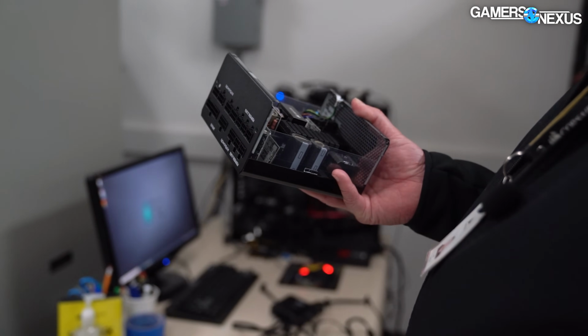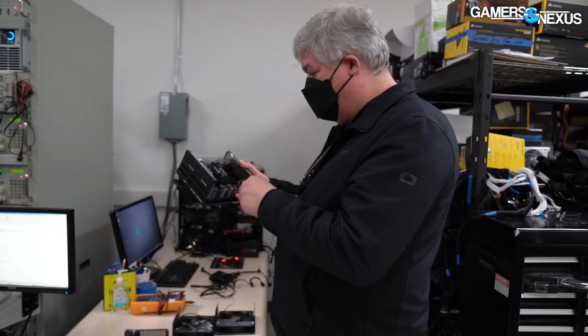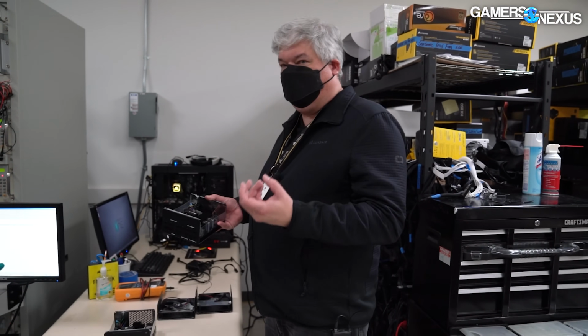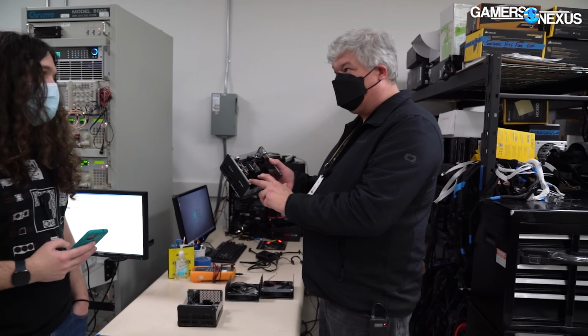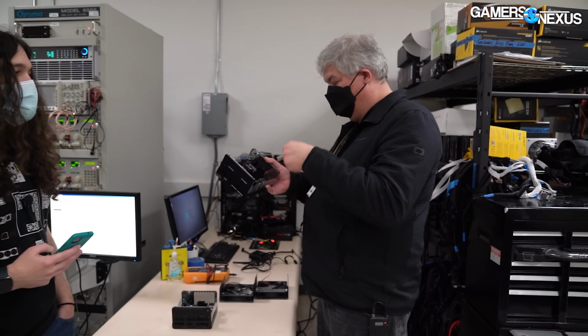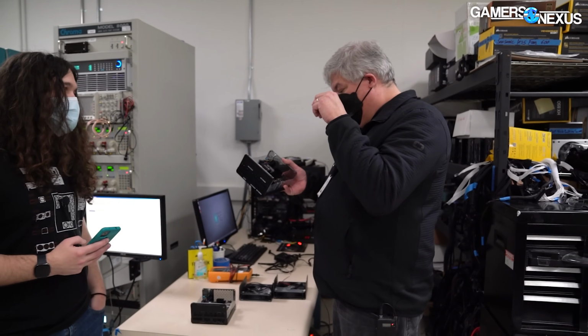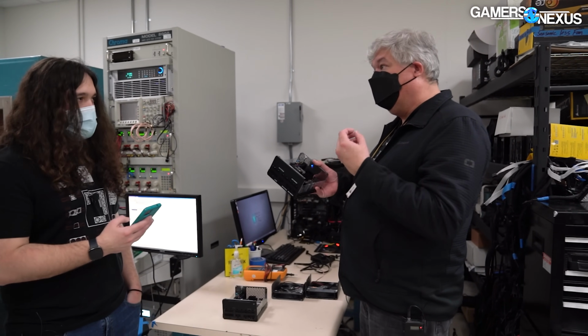That's not a bad thing. The reason for it is that with the pressure coming down from the fan, you don't want to only rely on the heat coming up from the components to the top of the heatsink before it gets cooled. You want to get the air through it, just like you were saying with the motherboard. And you have components down there that aren't actively cooled. There are no heat sinks on them at all, but they still get hot.